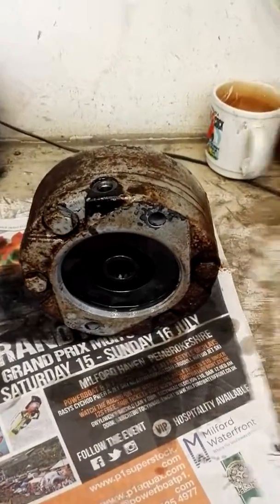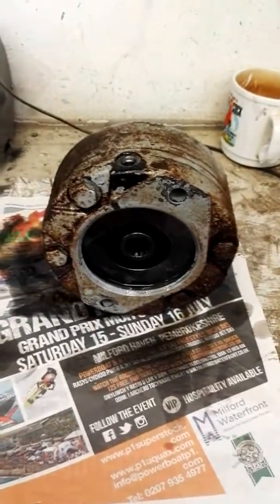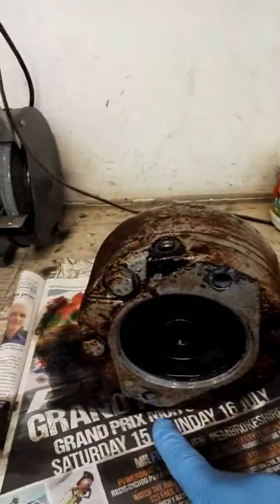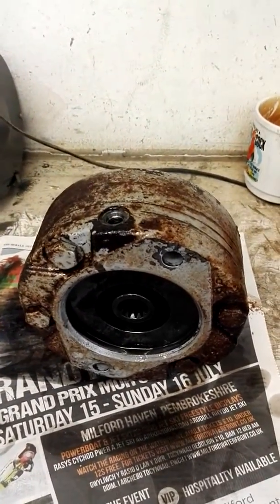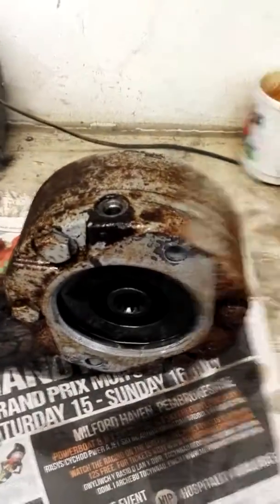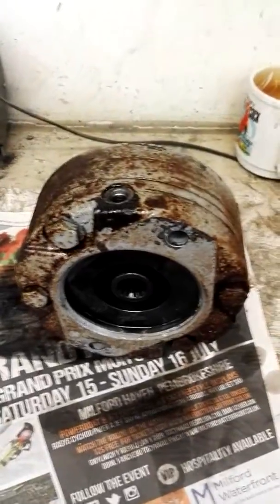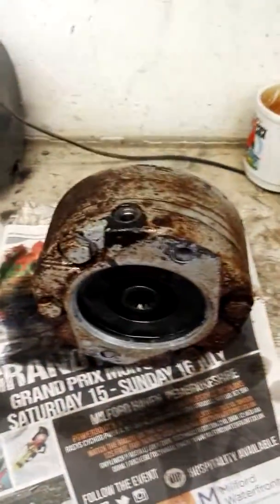You take these off with the machine as it stands on the ground. You don't take the wheels off, you don't have to jack it up. There are these two large bolts — take those out and the whole thing comes apart. You obviously have to disconnect the pipe. Get a tray, get a bucket — you will probably have hydraulic fluid dropping on your feet. Get lots and lots of old towels to mop anything up. Get some gloves. Keep everything nice and clean.